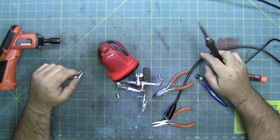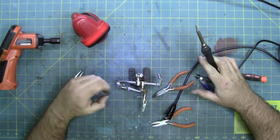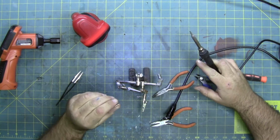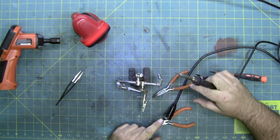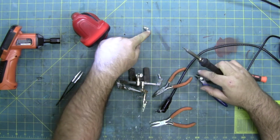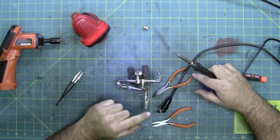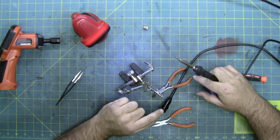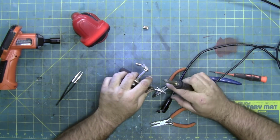All right, we're back. The easiest way I could do it, and it was by accident, is I got it so hot the collar came off, which technically the collar probably set off before, but there was hot glue on it. And I got it so hot that the hot glue started to melt, which separated the collar, the grounding collar. And the center pin that's broke, I was able to push out. I desoldered it from the, it's actually blue wire, I said green earlier, I didn't realize it was blue.